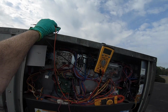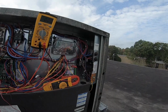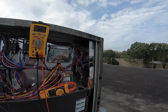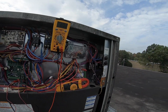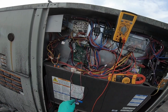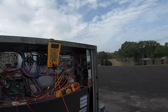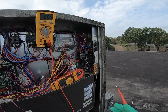The worst part of a job like this is it's a waiting game. You're trying to find what could be acting up, what's doing it. I mean, you're going to be shorted somewhere over here because you've got your 24 volts in to this. This is a test. If you don't want to wait, you could just put like a quarter between it. And that gives you the directions on how to test it right here on this door. You could cycle through, let it run each section for 30 seconds, or you can quickly maneuver through it.